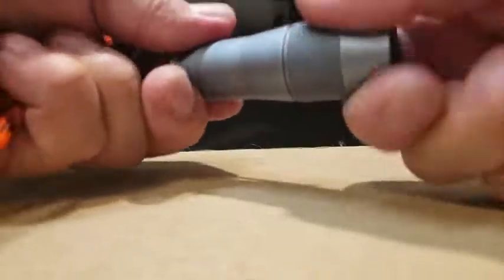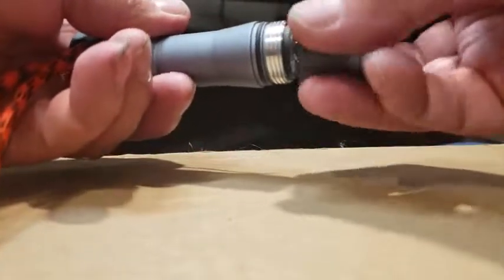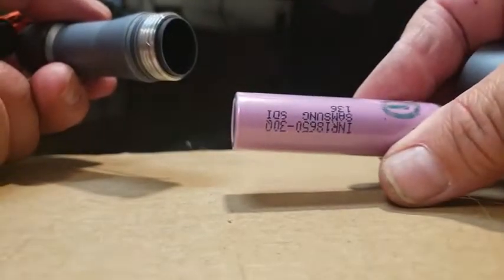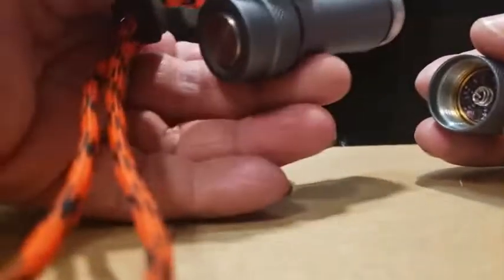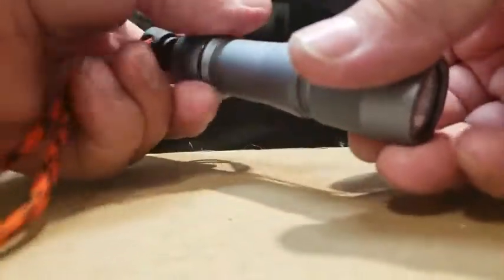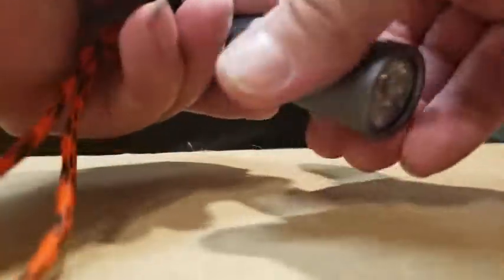Here's what's been happening: with the battery in, if I thread the tailcap tight, nothing happens. If I loosen it and take it again, sometimes it comes on. It's a 30Q standard battery, everything is the same — I've never modified the light other than adding a lanyard. For some reason now it won't work consistently, but it was turning on and stepping through all of its modes.